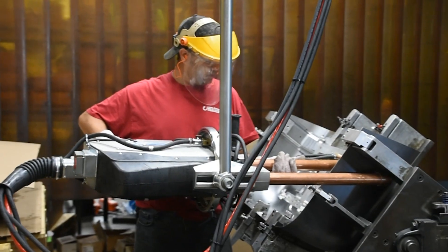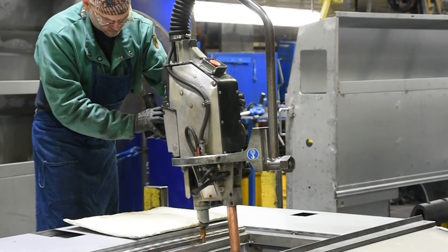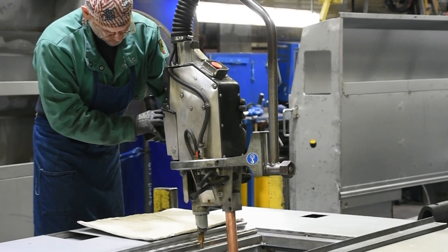We talk about expulsion quite a bit. Expulsion is that sparking, that explosive sparking that we usually see in a resistance weld. It's something we try to minimize if not totally do away with. That sparking from a spot weld is not a sign of a quality weld.